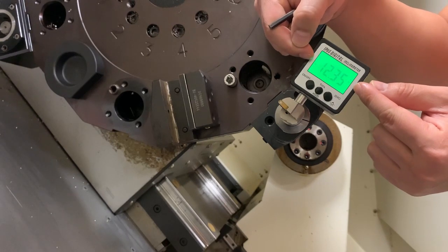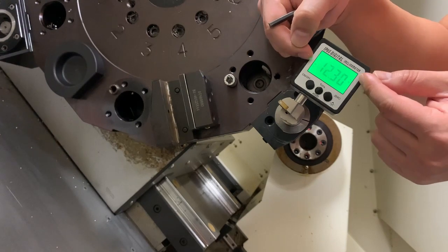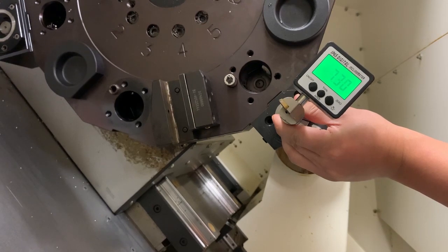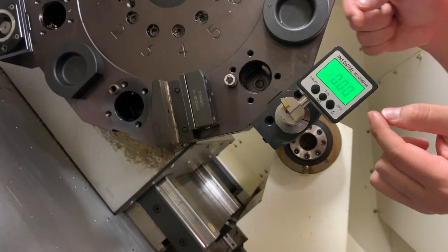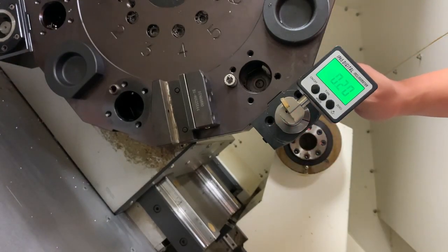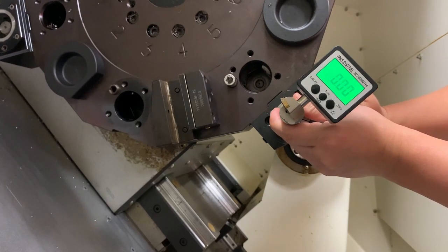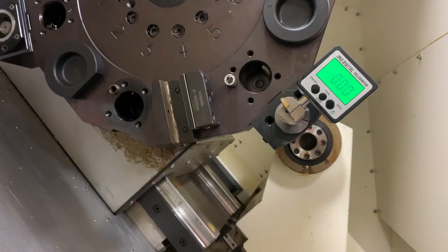You can see on the side of the screen there is an indication showing which direction you should rotate the tool to reach the zero reference plane. As I get close to zero, you will see that the two triangles suddenly change direction. What you do is just tighten the screw and then it's done. You can always fine-tune to exactly zero. So in just a few seconds, you have already settled the tool.